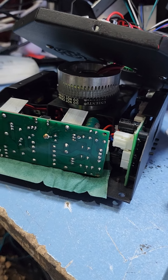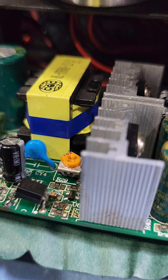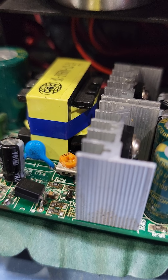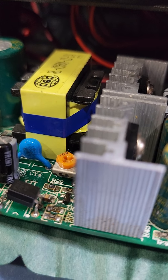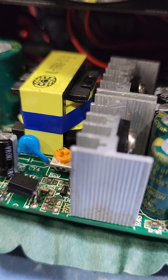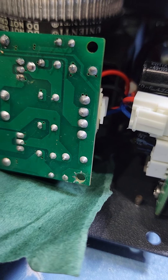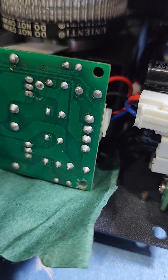So how can we fix it? You can see this variable device — that's the name. This component can make voltage go up and down. So if you change this 1k variable, if you replace this one, the device will work perfectly. Otherwise, you can connect a 1k resistance on the downside — connect this side to this side and it will work perfectly. Let's check it.